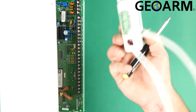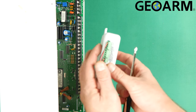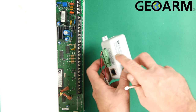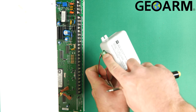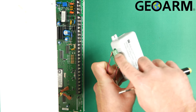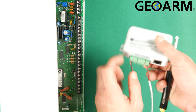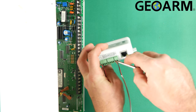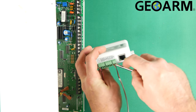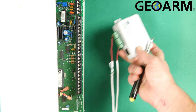On this communicator, go ahead and take a look at the connections real quick here. As you can see, I've pre-wired this. You're going to see red going to positive here, black going to negative here — those are going to be our two connections for power. Then you're going to have a red going to ring and a black going to tip. That's the way that this communicator is wired right now.